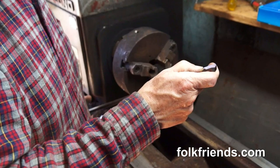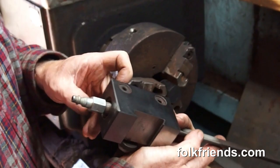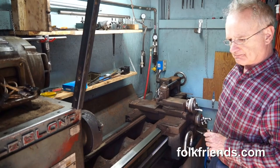This is a gun drill. You can see it has a carbide tip — that's hard metal, and it's brazed on here. This is the hardest material made by man. The shank is hollow, and we blow air through it to clear the chips and to carry coolant sometimes. I'm going to show you the process of running this lathe and drilling a hole in it.